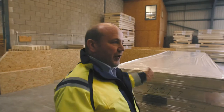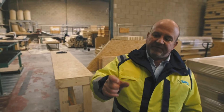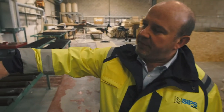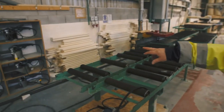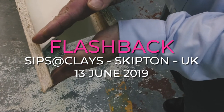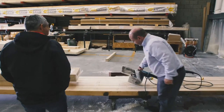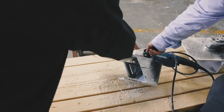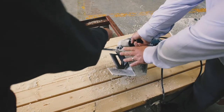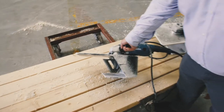Where we get an angle cut — for example on the ridge — we cut the bevel at whatever degree and then route out 50mm of foam on the angle using purpose-built angle grinders. That 50mm rebated out forms a parallelogram shape. These are bespoke angle cutters fitted to a nine-inch grinder — bespoke to this company.